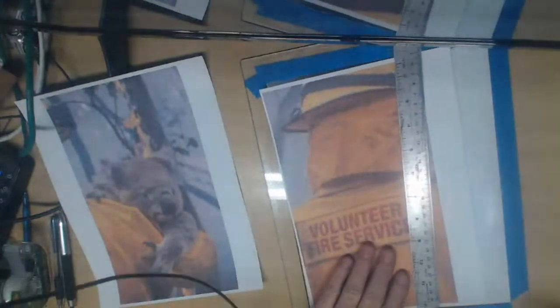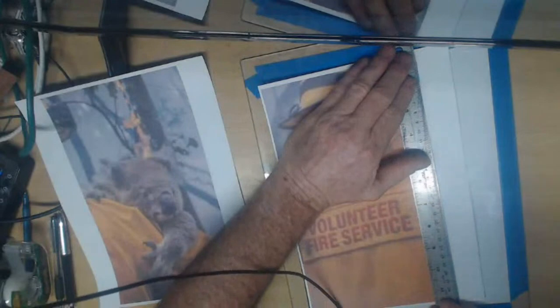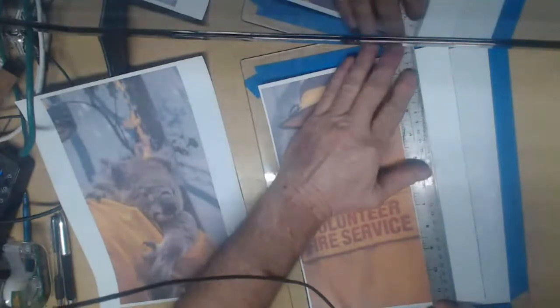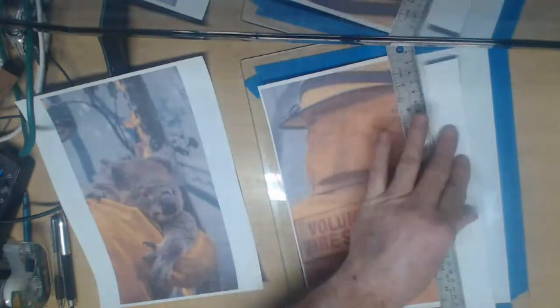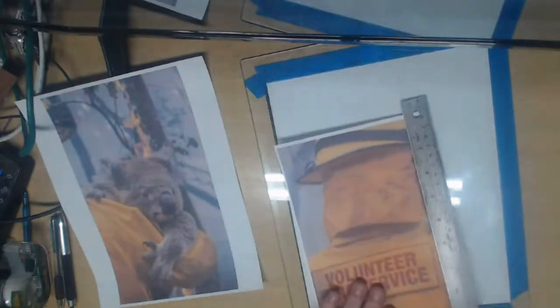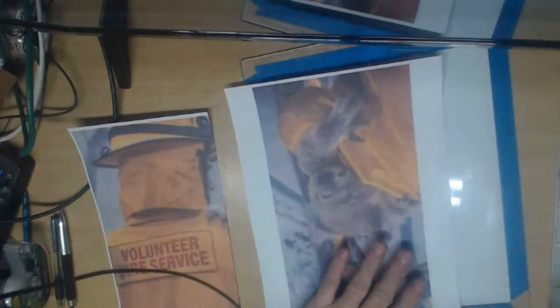And what I'm showing here is that we do scroll saw patterns on paper. That's why there's a piece of glass under here. It's not just for cutting the paper off. It keeps the pen from skipping on the texture of whatever's underneath the paper. And with the glass, there's no texture. If there is, then you're using a bad piece of glass. And so that's why I'm using the sheet of glass. There's a pattern in progress on the other side of it. It's why there's stuff taped to the back side of it.